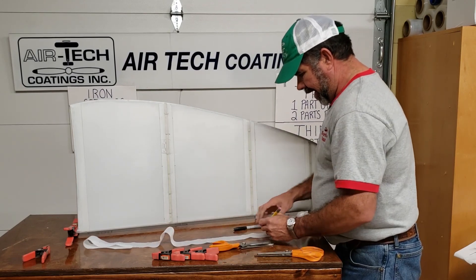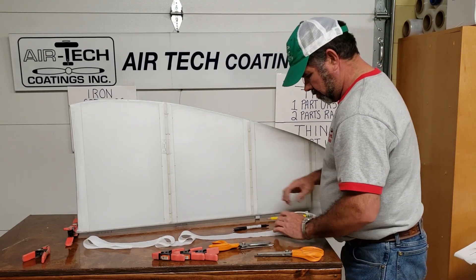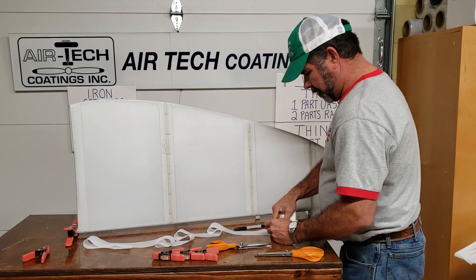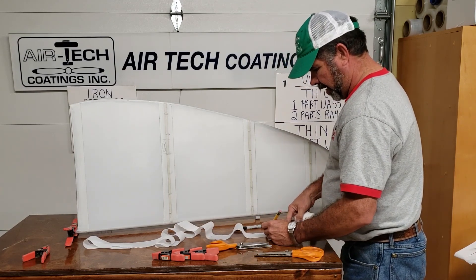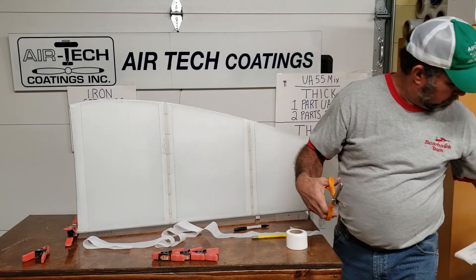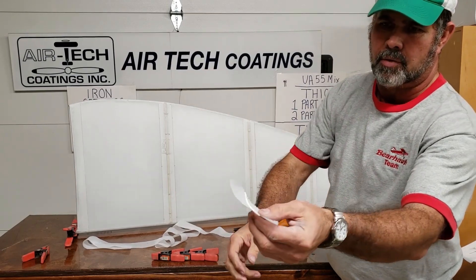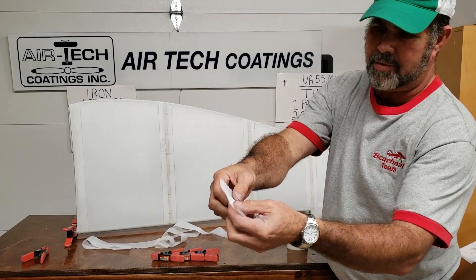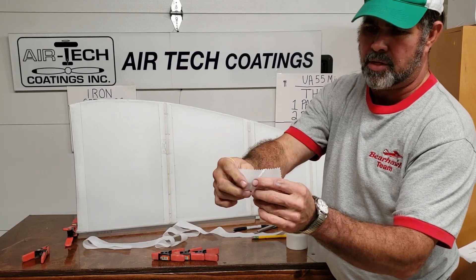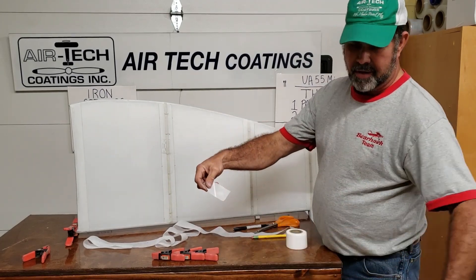I like to go on out and know about how much I'm going to use, and what I'm looking for is that sewn edge in there. I want to know where it's at — I don't want to start something and run right up to it. And that's the sewn edge — it's fine, it's perfectly healthy, but I don't like that in there. I always cut it, and I'd rather see two splices ironed down smoothly than see that edge in there. That's why I usually stop it — that's just the nature of the way they make it so they can have continuous runs.